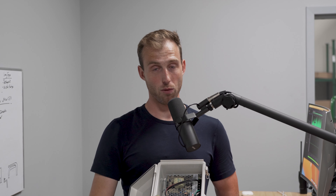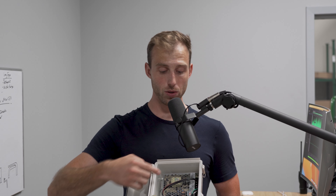So basically, power from your outlet runs to the transformer, it steps the power down to 24 volts, and that 24 volts runs to the receiver. The receiver is in charge of when it feeds power and when it doesn't — it feeds power when you click the remote, and stops when you let go. That's essentially how this whole thing works. This is where we typically have a potential problem: if the unit is shipped a long distance, there's a lot of vibration, especially all the way to the West Coast from Indianapolis, and the terminal connections inside can come loose.